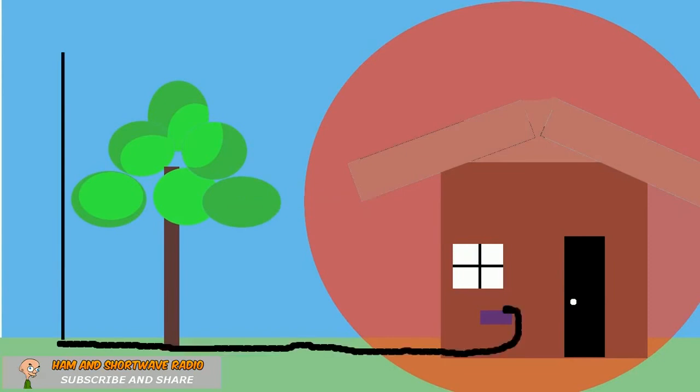It is the signal-to-noise ratio that we should be concerned with — adding length to our antenna does nothing if it is still in the noise zone; actually, it makes things worse. We want to reduce noise and increase signal. By using an external antenna of good design and fed with a proper feed line, we can place distance between the receiving part of our antenna system and our noise. That reduces the noise level, improves the signal-to-noise ratio, and allows us to hear weaker stations previously buried in the noise. Bigger antennas are more sensitive to RF energy, but bigger is only better when it improves the signal-to-noise ratio.